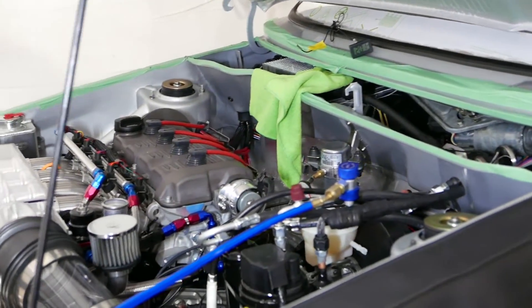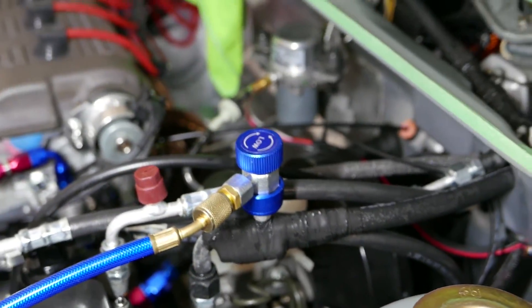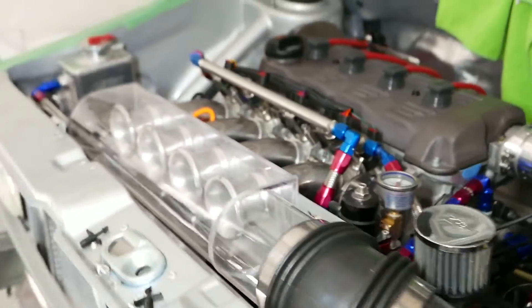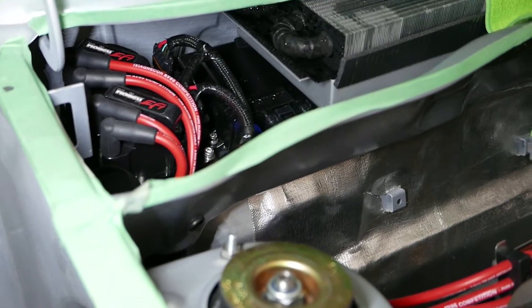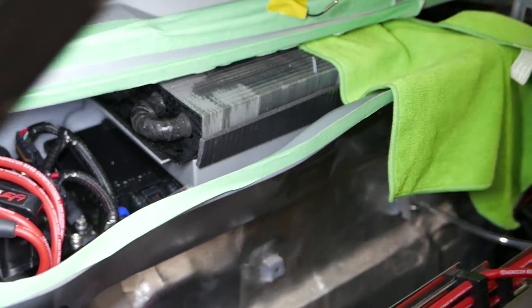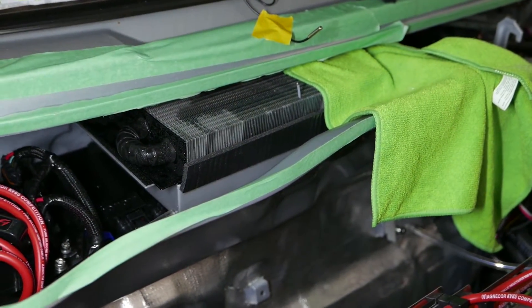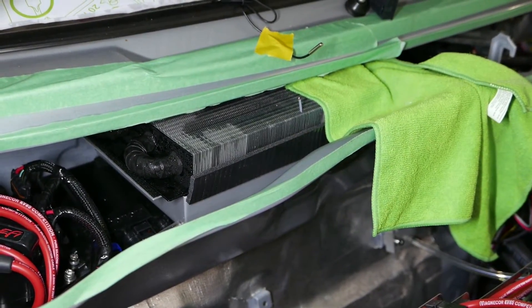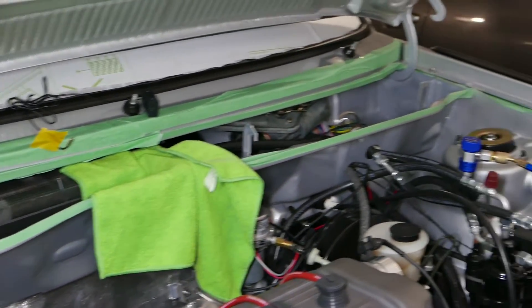The system is running nicely. You can see tons of frost on the thermal expansion valve, which is actually blocking some of the airflow on the evaporator because it's all frosted up on the far side. It's wanting to draw air in more closer to the blower side. There's no question this thing is pumping out lots of thermal BTUs of cooling because everything is frosty.